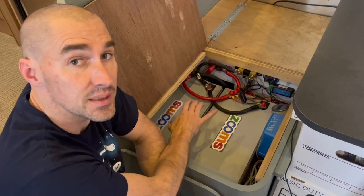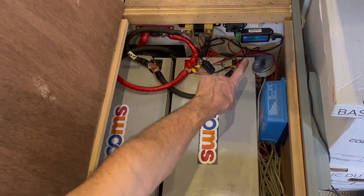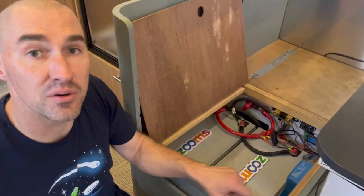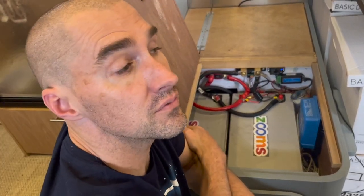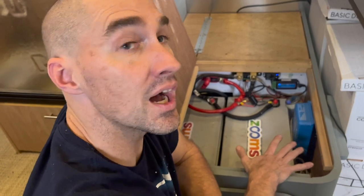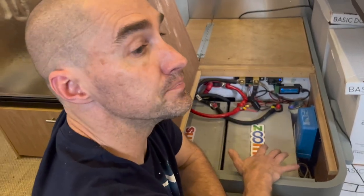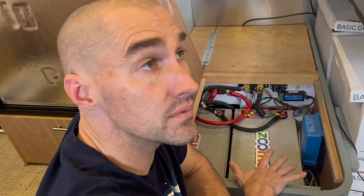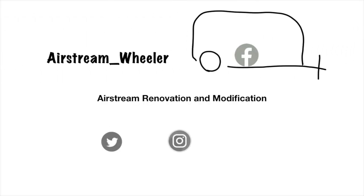This is the cleaned up, tidied up version. I've made improvements in how things are wired and connected, and I've also got our Bluetooth monitoring attached on the back wall now. I'm definitely not a professional installer, and we haven't made many videos featuring the batteries and Victron MultiPlus system partly because I don't want to demonstrate anything that anybody might copy and potentially have a problem with. As for the mistake I made — I'm lucky we caught it when we did. It had been okay for a year, but at a certain point something triggered it and it got very, very hot and could have started a fire. It was an unfortunate but important learning lesson, and I think I've made improvements here to ensure no further similar issues.